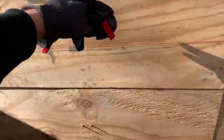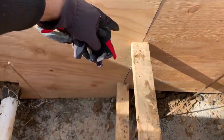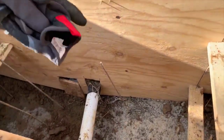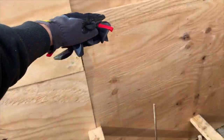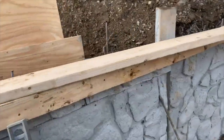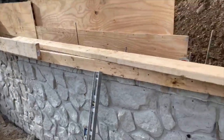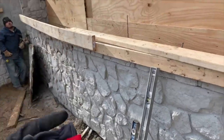But now you have a weight against this, okay? And it's structured, it's held up by these boards here. As I put the concrete inside there, it goes straight up, and then I bring it to the top cap over here, bring this across here, and now I have a capstone. I have a capstone automatically with the whole panel. The panel, as thin as they are, believe it or not, holds up all that concrete.